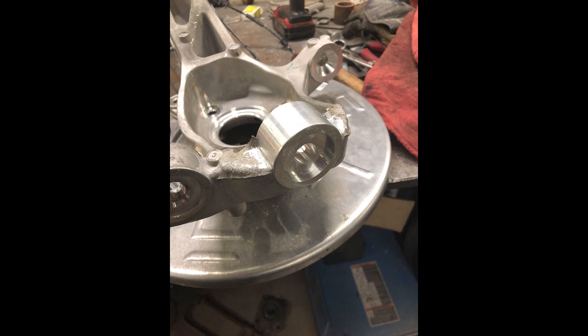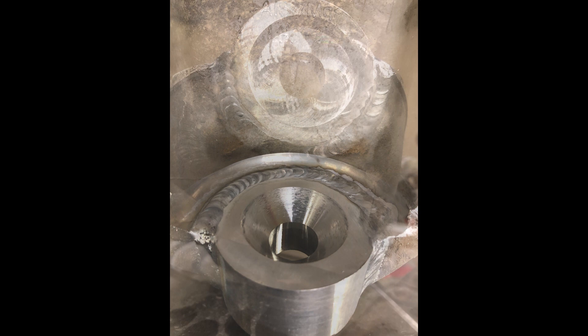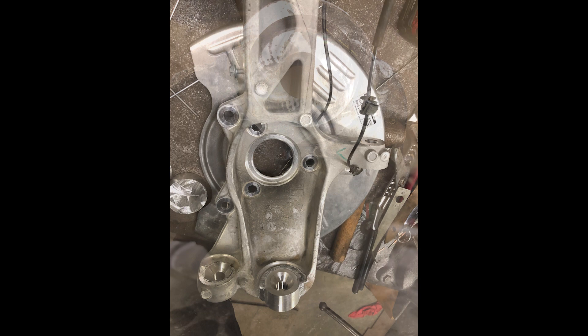You can see the close fit of that new taper — how well that worked out. A quick preheat on the spindle, fire up the TIG welder, and blast this thing home. Everything lined up really well; the cast is a little bit dirty but it welded pretty well.